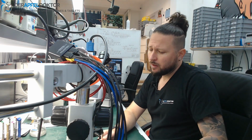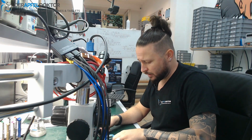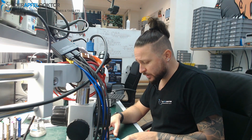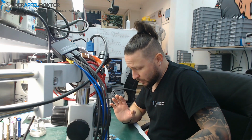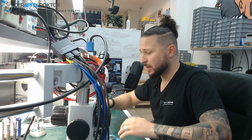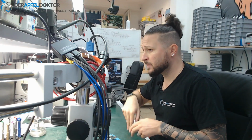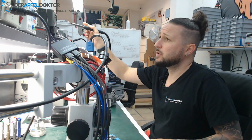In this case, I've done so many videos in the last half year in English, and it's hard for me to find new things to show you. So I think I could show you how to separate the RAM and CPU and how to reball it, because normally when I prepare the swap board, I take the CPU and the RAM off in one, throw it away, and prepare the board. But today I'll show you how to separate the RAM from the CPU, take out the CPU, reball the CPU side of the CPU, and reball the RAM. That is what I wanted to show you today in the morning.